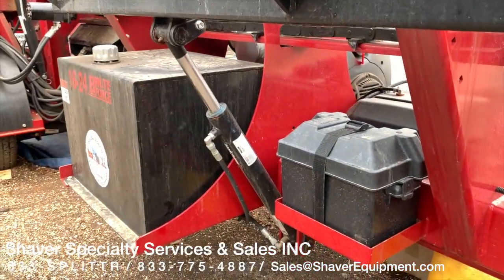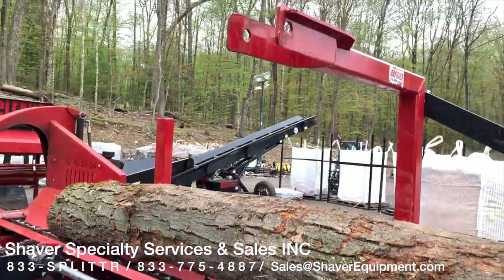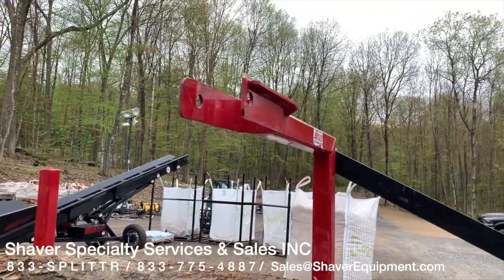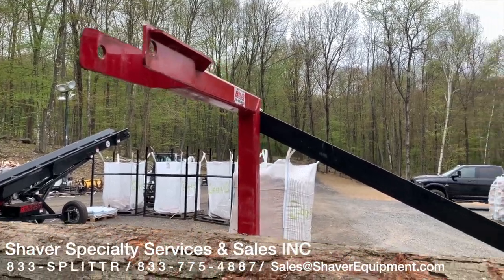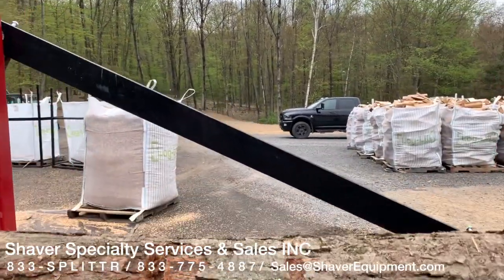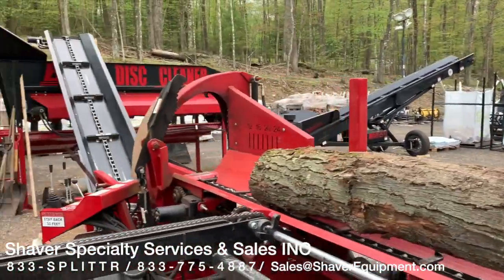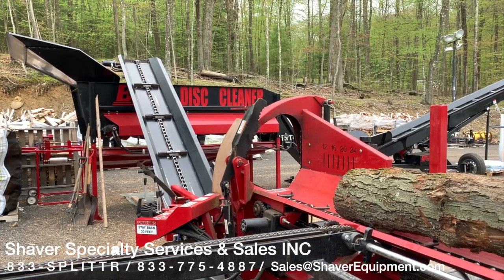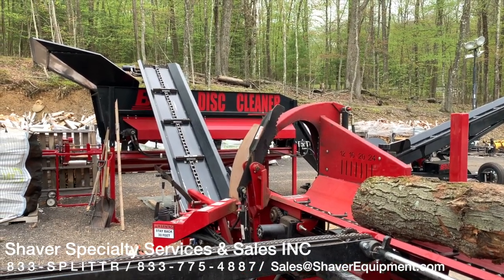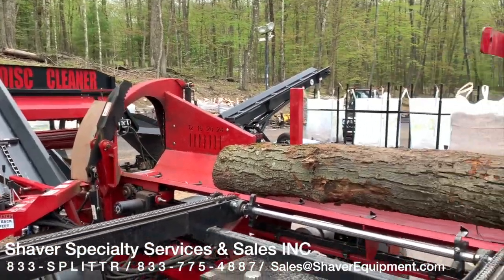So there's the hydraulic ram for easy setup. The live deck does come up and it will nest inside of the bracket there for transport going down the road, so you're not over width. These are the support keepers for the conveyor. So also while you're going down the road, you can pick that up. And I think it's right around 13 feet, because it's 12 foot. Elevator doesn't quite go straight up and down, but you are about a foot off the ground.